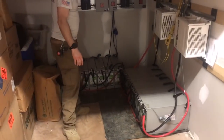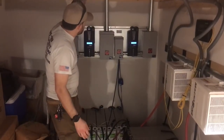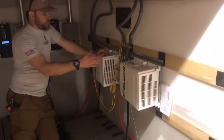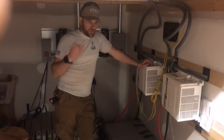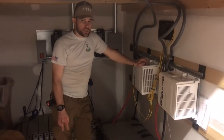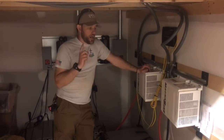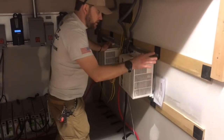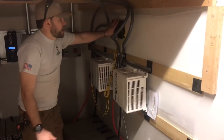The solar system is broken up into two segments coming in on separate charge systems, very cleanly into the house back wall. With the Magnums we've got 60-amp service feeding two different air conditioning systems, refrigerators, a dryer — pretty much anything in a standard home. The split stove is propane and electric. The customer is moderating their usage, and later we may be adding a third inverter as a second slave unit.